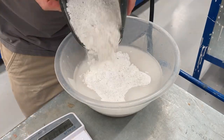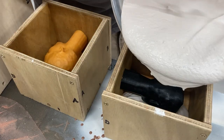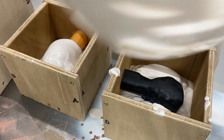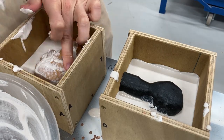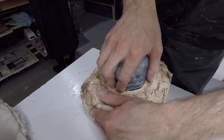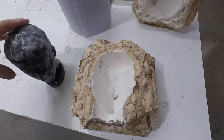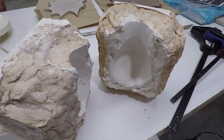I'm not good at throwing things on a wheel, and I want to make a repeatable mold that can capture all the detail on my face. So we're going to use slip casting. We take plaster and create the negative mold of what we want. I used the PLA 3D heads and plywood boxes, which I added a layer of soft soap to so when the plaster dried, it could be demolded. This massive print and mold turned out really well, and you can usually get around 100 pours of slip until the plaster becomes unusable.